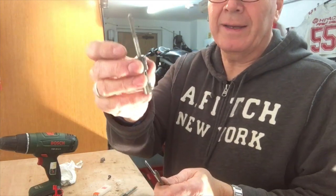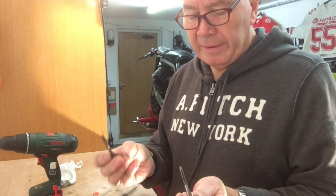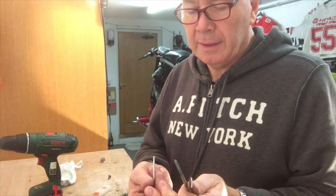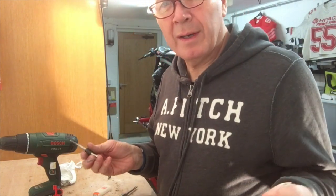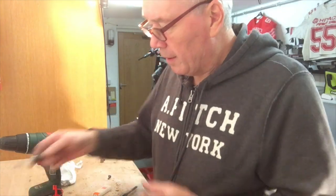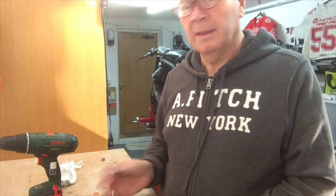You can, I guess, in theory, do it with a straight tap, but it's almost impossible. And you'll end up going at a crooked angle and screwing up the first part of the thread. So it's always better to get a set of three, but they don't seem widely available, which is amazing. And I don't have any decent tool stations near me. So that's how we go. They're all ready to weld on. Let's get on with that then.